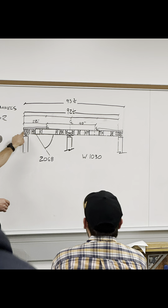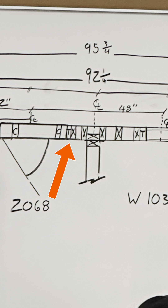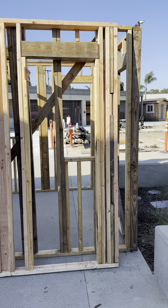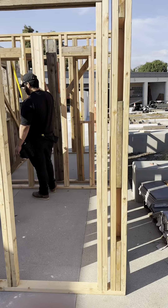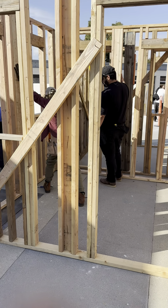In my first class, once we got through the first two slow weeks, we went right into laying out walls. Our first task was to lay this wall out. Our teacher went through the different parts of it, like the corner where you have the stud, blocking stud, and then the butt wall, and then laying out your king stud and your trimmers for your doors and windows, as well as channels. They gave us the steps to do that, and this is the wall that I built using those steps, which is so cool. Then once the rest of the class laid those walls out, we brought them together into a square, which was pretty cool for the first three weeks.